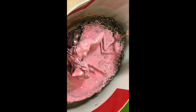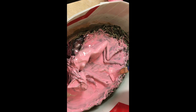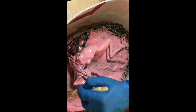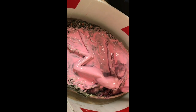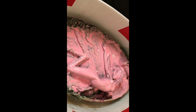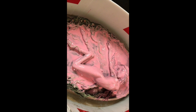We're doing all this so that we can follow up with a straight pour. When we straight pour it, all this work will marry to it and hopefully we got all the detail work out of the way. I'm not using any kicker or extra catalyst, so we've got a pot life of about an hour — it's like an hour of chasing bubbles and chasing pools.